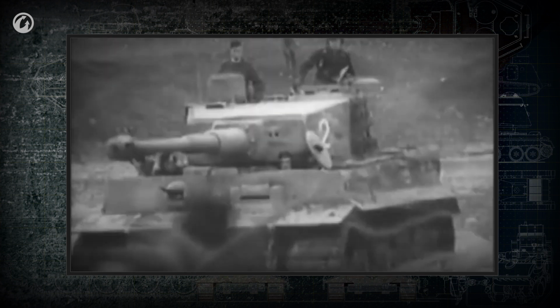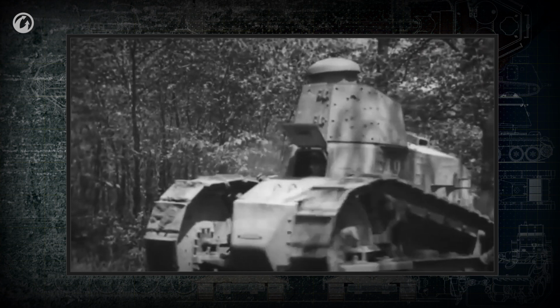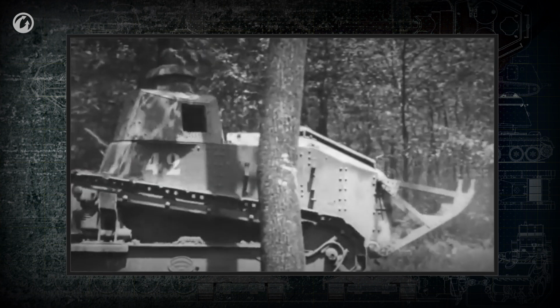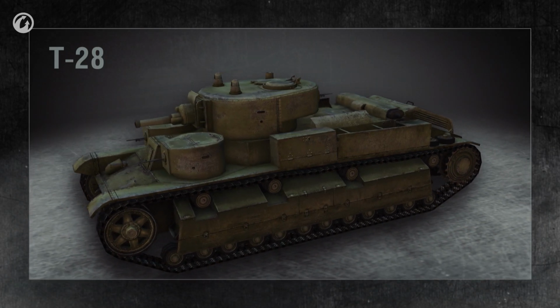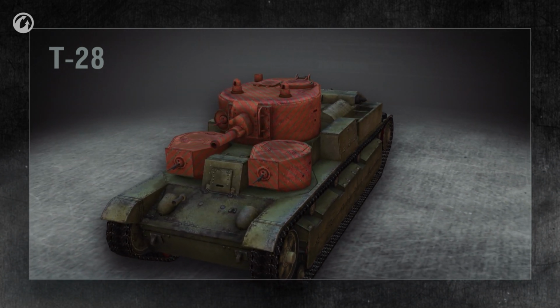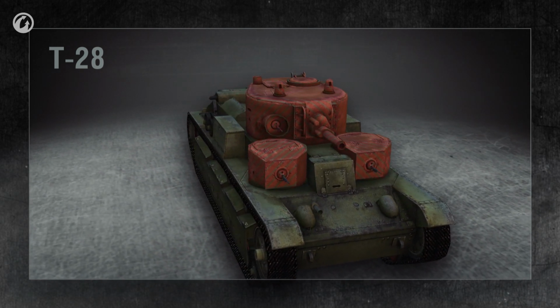Vertical armor plates are usually less resistant to penetration than angled ones. That is why, even in the era when turrets, like hulls, were based on an internal frame, some variations with rationally angled plates appeared. Turrets made by welding can roughly be divided into a few types. Cylindrical turrets resemble a cylinder without angled sides, something like a barrel.